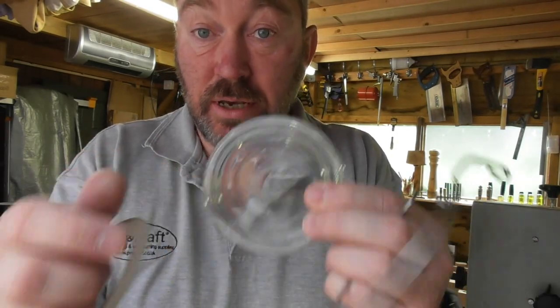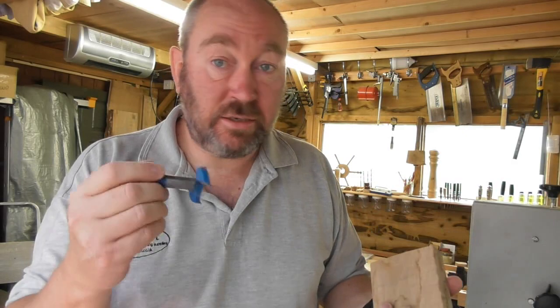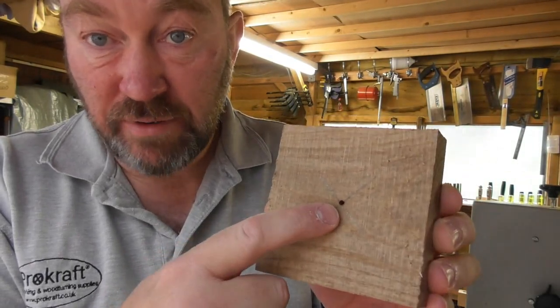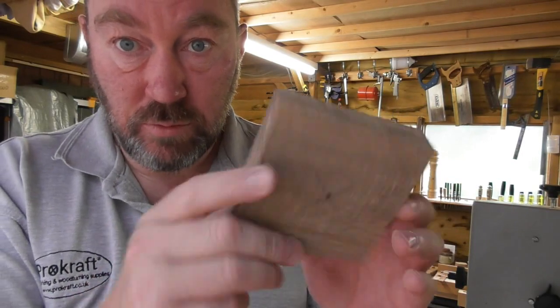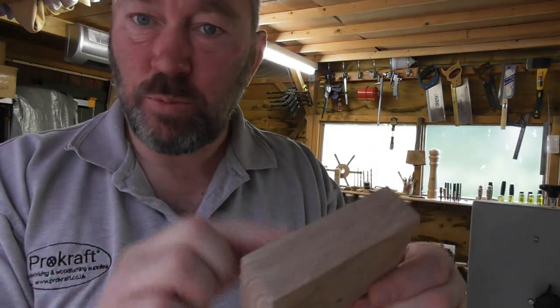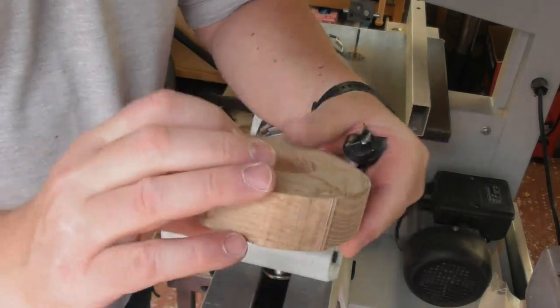All I need to do is make a bit of wood with the same dimensions to take the wire and the rubber. What I'm using today is a little scrap of ash — it's completely warped. I'm going to use a 45 millimeter Forstner bit because that's the ideal size for the hole for one of these kits. You don't have to use one — you can mount the wood on your lathe and cut it out with wood turning tools if you prefer. I've marked the center of the wood and drilled a very small hole, about three and a half millimeters, right the way through, so I've got a center point on both sides to help line everything up correctly.